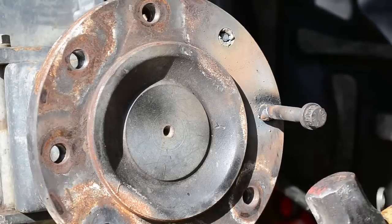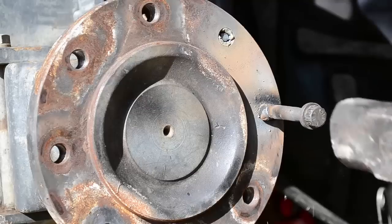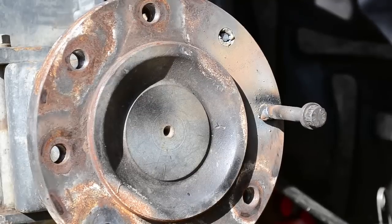Another good little smack. Now I'm gonna chase this one with 7018. 6011 is real good, but it's brittle. So it helps to have a little ductility in there, and that's where 7018 comes in. Once again, 3/32, same amps.